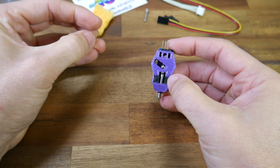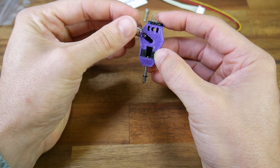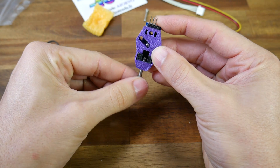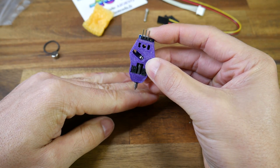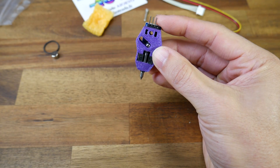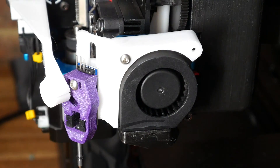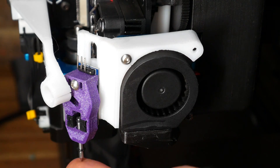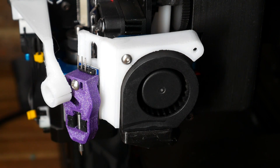To let the pin drop so we can take readings when we home, we mount the larger magnet to the left, and that allows the probing pin freedom to drop down and make our readings. When we're finished probing, we simply need to drop the hot end down low enough for the magnet to retract the probe. As the printer homes, the large magnet pulls up the ball bearing, the pin drops down, and when it touches the bed it trips the optical switch during the auto bed leveling probing. It looks pretty novel, and I really appreciate the lateral thinking that's gone into developing this innovative solution.